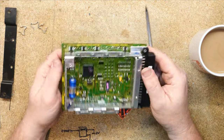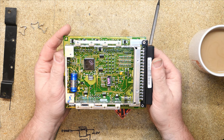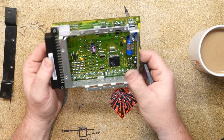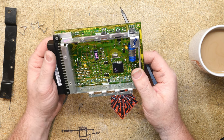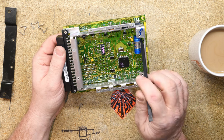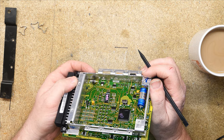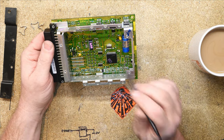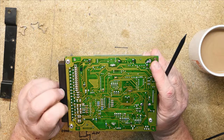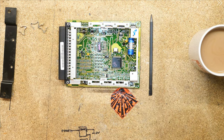There's really not much to this — it's not very exciting at all. Someone has reverse-engineered this and written an Arduino version of the controller, and I'll try to find that and put a link below. If you have one that is completely dead, check the protection diodes and these tantalum capacitors which are known to fail. IC8 is a precision voltage reference, used in conjunction with the height sensing. Troubleshooting this module should not be too hard for anyone who knows how to use a multimeter — you'll struggle getting through the conformal coat, but other than that it shouldn't be a problem. Anyway, take care.